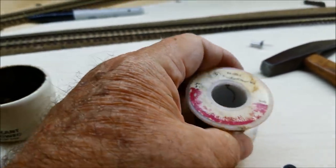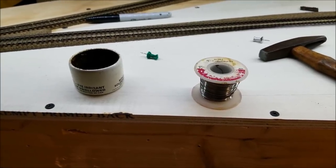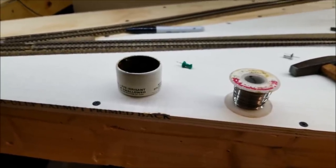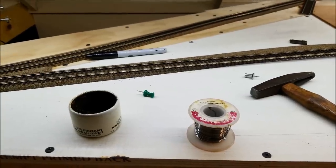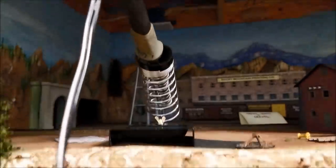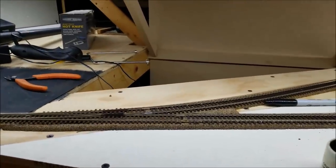We're going to heat up the soldering iron — I have a 40-watt soldering iron here and it's heating up. We're going to solder those joints. Also, we drilled the hole for the Tortoise machine before we put the switch in place — we used a smaller drill bit first, then went in with a bigger one to ensure there's enough room to place the wire in. The paste turns to a liquid and it makes the solder run. That joint is well soldered. Got to have a good hot soldering iron for that paste to run in there.